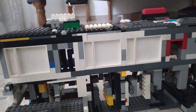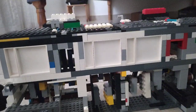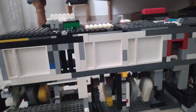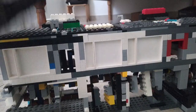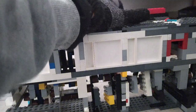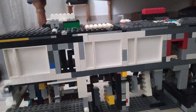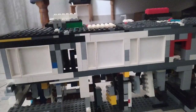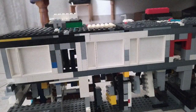It's so smooth — it's really satisfying to rotate. We have a cross-plane crankshaft here; the flat-plane wouldn't work as well. It's also self-starting — I'd like to add a starter motor, but when I turn on the two vacuums it already starts and I don't even need to crank it. The engine is also really heavy — it weighs 1.2 kilos but it's really sturdy.